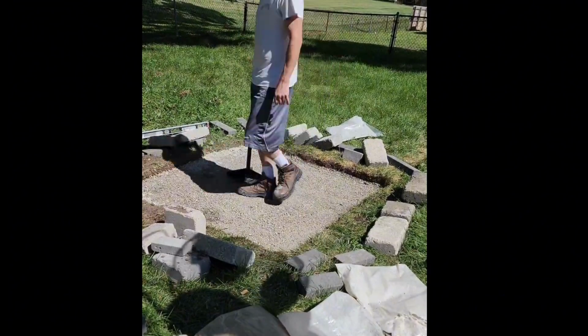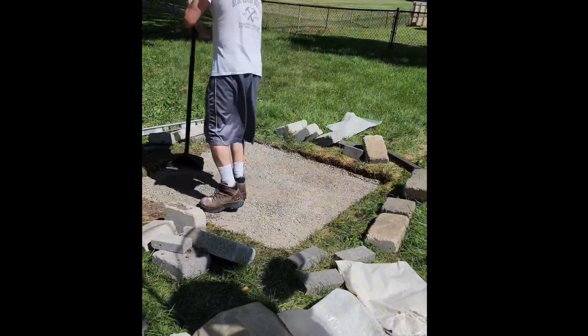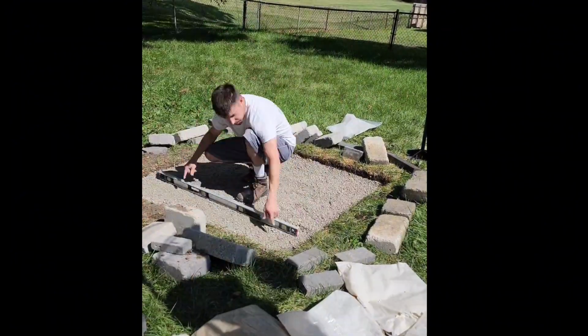And this is tamping. This is how you compact your dirt, soil, whatever base you're using, sand. They use it before pavers. All it's to do is compacting everything, make it nice and tight. In between, like you put it down with a thin layer, you spray it with water, wet it all down, and you're gonna come back, tamp it again.